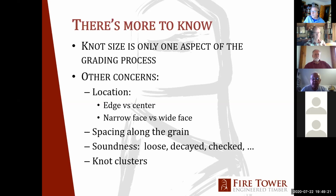What if you have multiple grades of framing members, let alone different species, used in existing structures? If you assume all wood species are the same, do you average the grade, take the worst grade, or some form of standard deviation? I'm going to toss that to Ron. Ron has done a lot of in situ studies. I'd be willing to bet you're going to see a relatively consistent use of species, but grades obviously may vary. So Ron, what do you think?